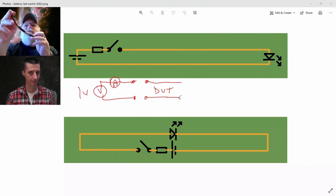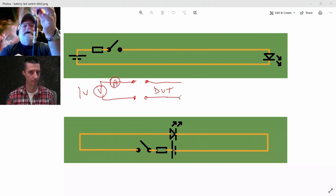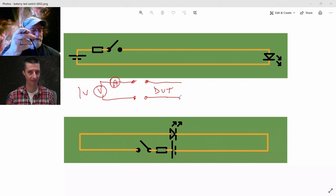And the end, of course, is open over here. What would the ohmmeter read when I connect between the signal and return on my 30 centimeter long cable? Nothing. You mean zero? Very high impedance. Very high resistance. Being open. Yeah, it'd be an open. Resistance is open, right.